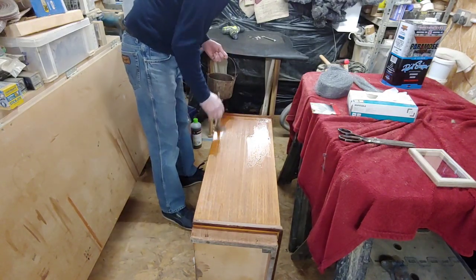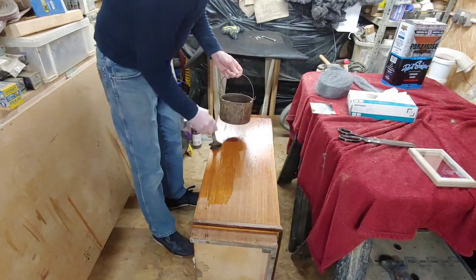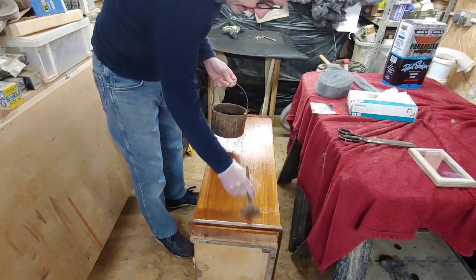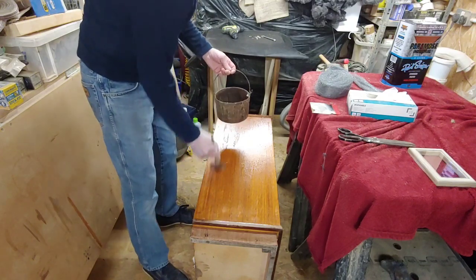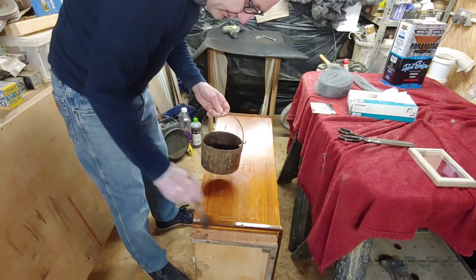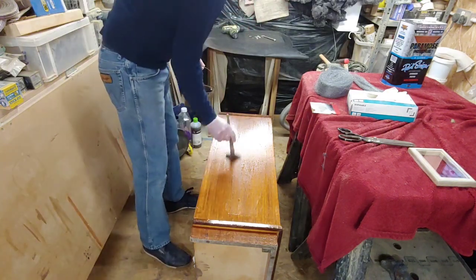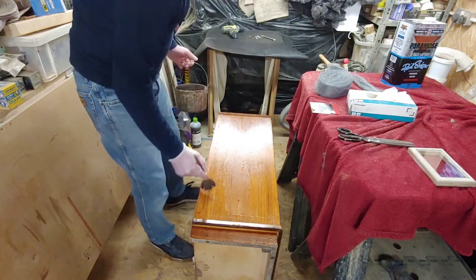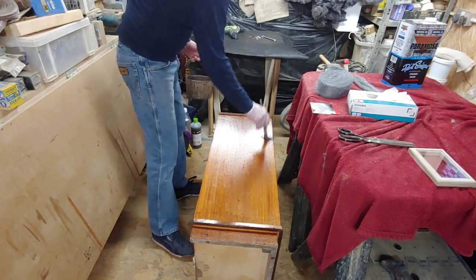So we're going to give another coat now, and then we're going to wire wool it off. And hopefully that should do it for this side. But if you noticed on these speakers, the tops are the ones that were in the worst condition. Now this one, again, the other one was in a lot worse condition than this one. This one's got very minimal veneer missing, so I'll only have to do some light filling on that, as opposed to that one that was in quite a state. Now I could have re-veneered the tops, but I'm quite confident that I can bring the tops up looking great with a false grain over the bits, and you won't even notice it.